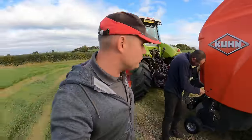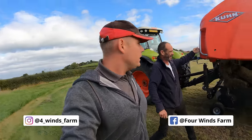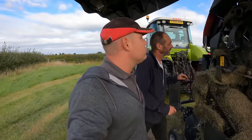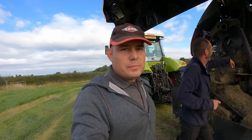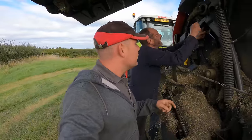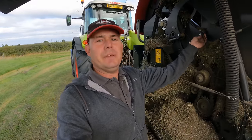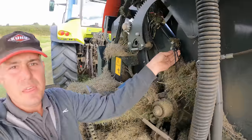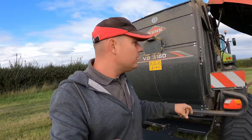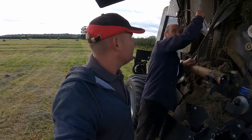When the baler first came to us we had just a couple of small tiny issues, so we're going to talk about those first. We've only just finished baling so it is going to be a bit dusty. One of the issues was one of the automatic oiling points. It comes from the other side. Basically this tee piece here was on the other side of the baler, right off the pump, and it was only pumping through one of the lines. It was domed somewhere there and then it hadn't got the pressure to push it over.